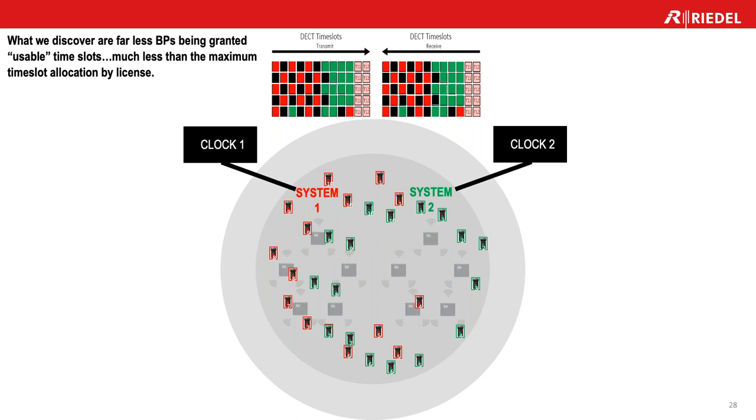But the sync outputs and inputs on a FreeSpeak system aren't necessarily PTP sync or compatible with plugging into Riedel. Right. You'd have to have some kind of conversion device or protocol. Right. And really the key there is that any decent third party PTP capable time-based generator is going to have multiple format outputs. Like an Evertz 5602 is going to have PTP outputs, word clock outputs, and baseband, bi-level and tri-level video sync. So you can find that so that the heartbeat is common to all those formats. It's just that they're transcoded into different formats, but locked to the same heartbeat from that master generator.